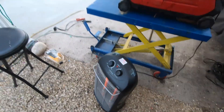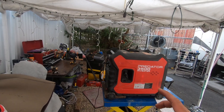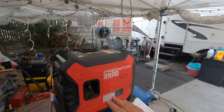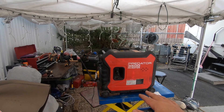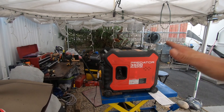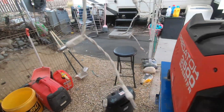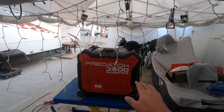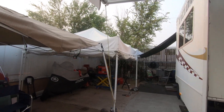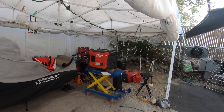With this heater load it's running nice and even. I did end up straightening out the push rods and adjusted the valves again, and the generator is running pretty good. We're up here in Reno at about 4,500 to 5,000 feet, so we're right at the limit where you should be rejetting. It varies with temperature too, so it's difficult to nail the exact jet, but it's running a lot better than it was with the 76 jet. I tested it with a fairly heavy load and it ran perfectly. Thanks for watching Immortal Engines — if it was helpful, please subscribe, hit like, leave a comment, and I'll see you on the next one.